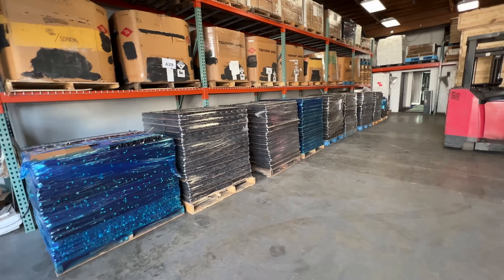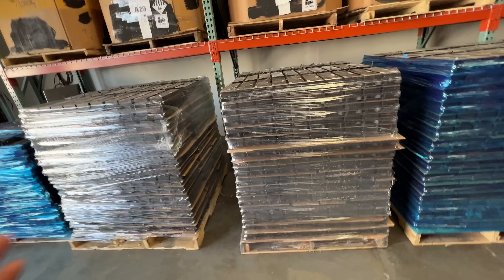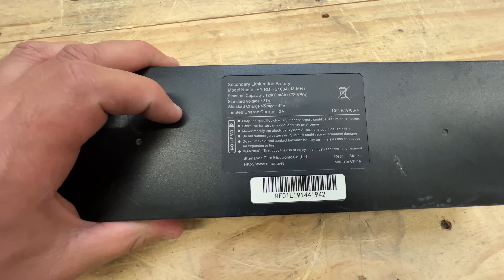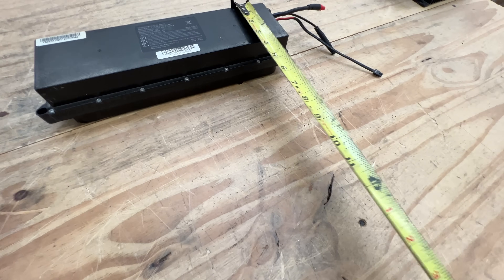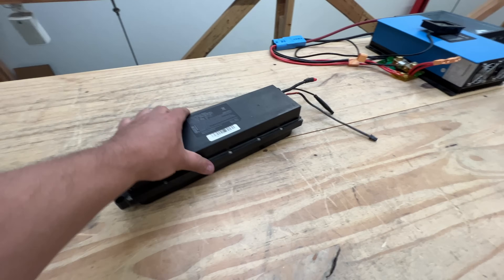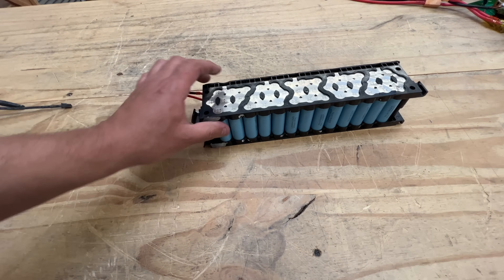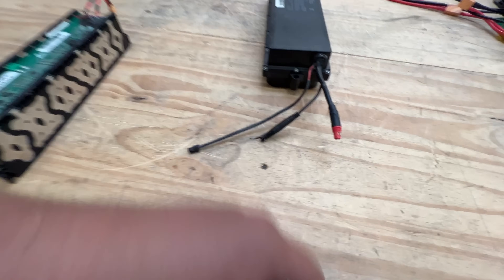These are going to be on our website at jack35. I want to look at this one closer — let's take it to the bench and see the cells inside and what it takes to get one working. Here it is on the bench — you can see the model number right there. Size-wise it's about 13 inches long by about 4 inches wide by about 3 inches tall, so they're a bit taller than the other ones we have in stock. It's got the BMS board on top, six MOSFETs, and 40 cells stacked three tall. They're obviously the MH1s.